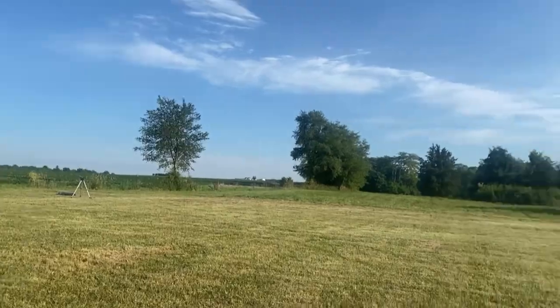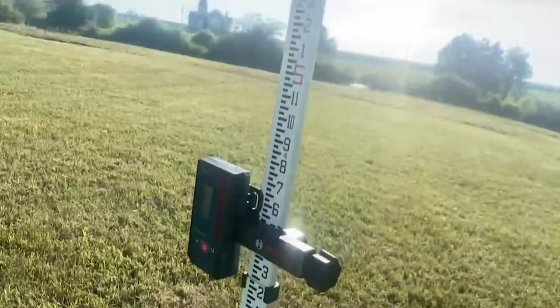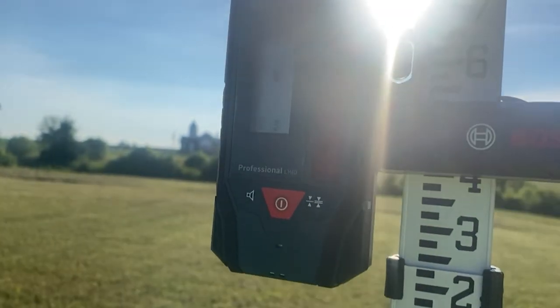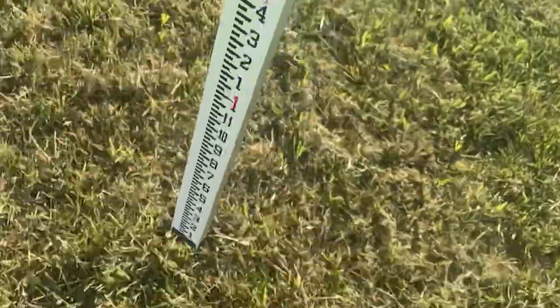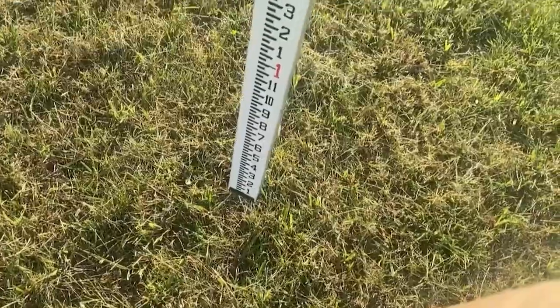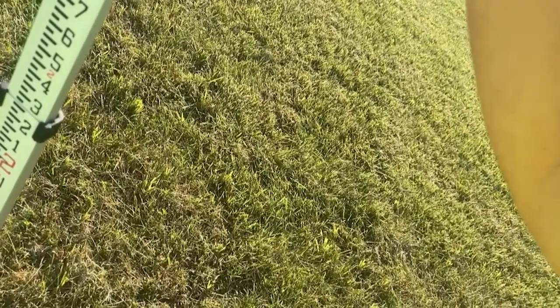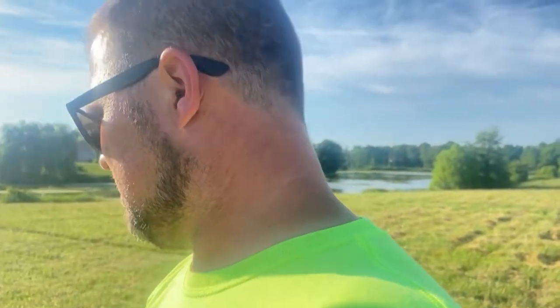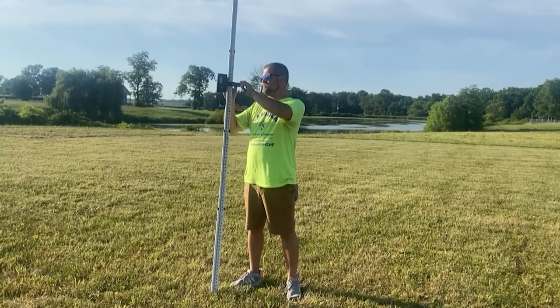We shot grade for the front door over here, and I'm going to be honest — I thought we'd have a lot more fall than this. It's not quite a foot and a half of fall. This is all really informational — we're not getting any real readings right now for a grade, this is just for my own purposes to know how much fall we've got if the house sits here. I think from front door to back door, about a foot and a half of fall difference from the foundation in the front and the back. That's not bad. Now I want to take a look and see what we're going to have where I want to put the septic line. I'll show you how to shoot grade to find your fall on your septic line.